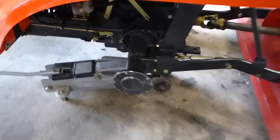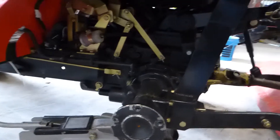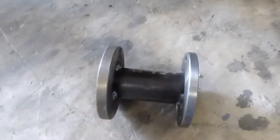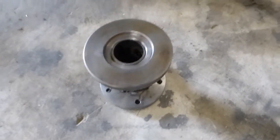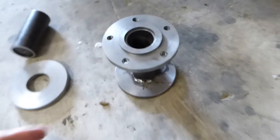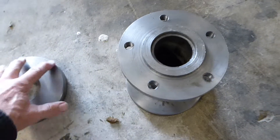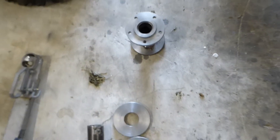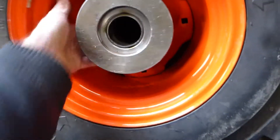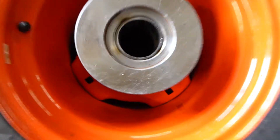I've just been building some wheel spacers for the tractor, just to space the wheels out a little bit to work a bit extra on steep country. I've got this one here that's just tacked together at the moment. What they do is fit on there like that, and I'll put some bolt holes through this one and just bolt the wheel studs through. I thought I'd show you how I did all my wheel holes — this one fits on there.